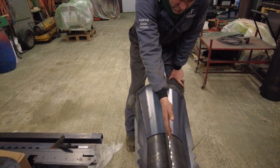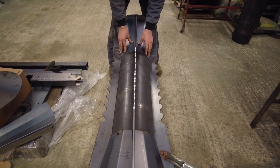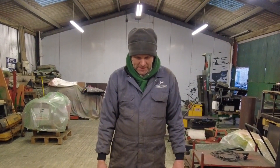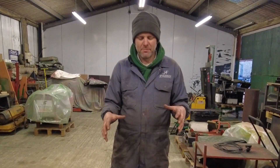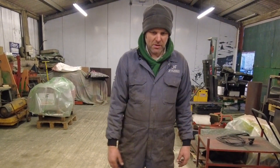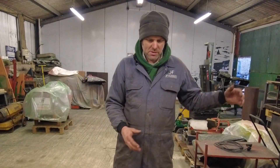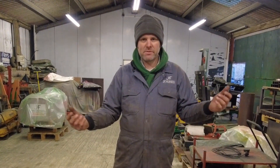Some of these, because of the way they're cut, sometimes they'll have a bow in them, but putting these in basically gets them all straight. That's sort of how we put the crop rollers together, and then there's a lot of welding to make them strong. One good thing about them was - because they're quite heavy with a lot of steel in them - I thought they'd take quite a bit of initial force to get them to rotate, but actually they take nothing. When they're on, you can just set them off spinning and that weight keeps the inertia rolling, so when you pull out of one end of a row it's still rolling to go into the next one - it's not having to restart every time.